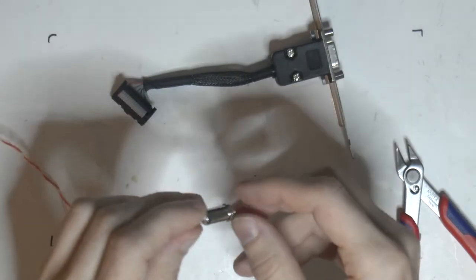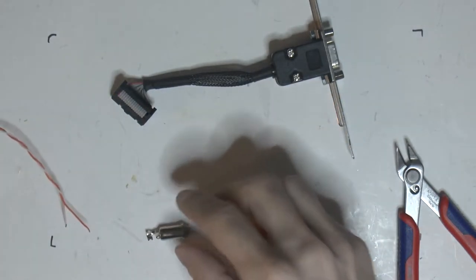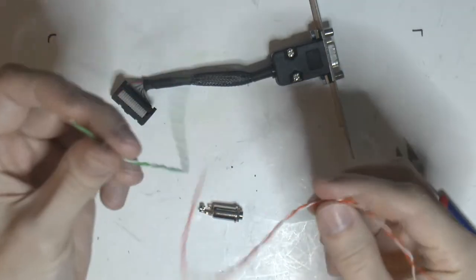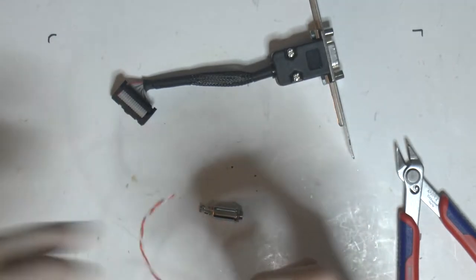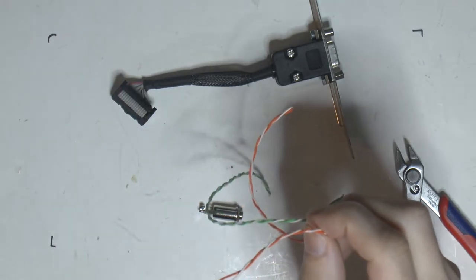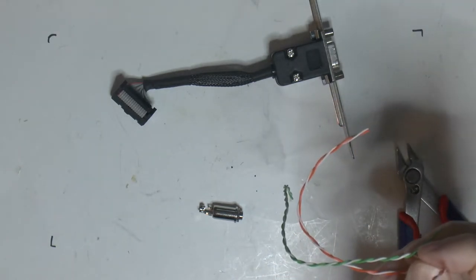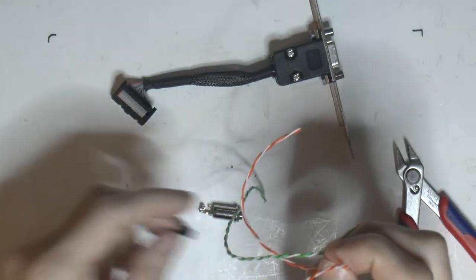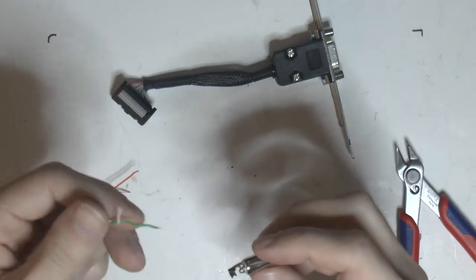So this is the audio jack, or normal 3.5 millimeter stereo plug. My plan is to use these two network wires here. White for ground, so two grounds, and then we add some connectors at the end, two of them, because of the way it works on the card. On the card, the two bottom pins are left and right channel, and the two above are ground, so having two plugs we can swap the channels if we get them the wrong way. So I'll begin by adding the grounds here.